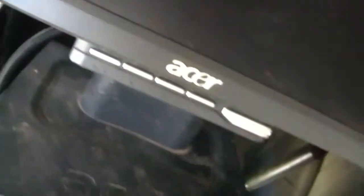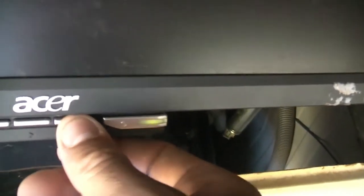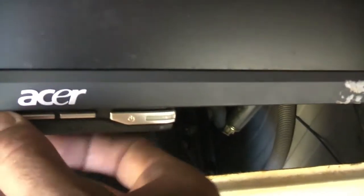Oh, I've got a green light. Yeah, it's looping. It turns off. Yeah, it's booting up and looping. Okay. Right, there might be a capacitor in the power supply that's gone. Let's get this thing apart so we can repair it. I'll take it apart. Little Chinese screws there.